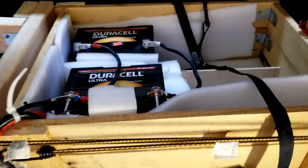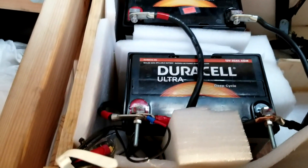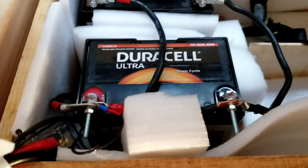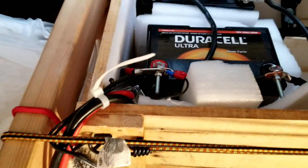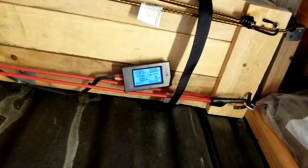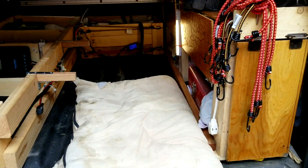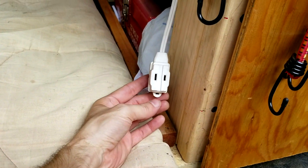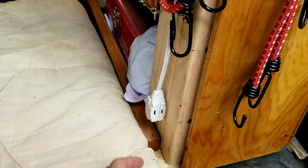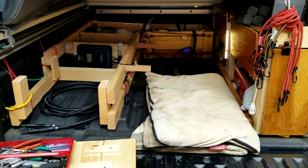There's the switch for the charge controller to turn it on and off. The batteries are back here in the battery box — I have room for four, and when I go out longer I take my four big ones. I've put insulation and cushioning in there to keep the shunt resistor away from the positive line so it can't short out. The install is alive — it's showing 12.89 volts. I have 12 volts DC available here, and just across the way I have 110/120 AC from an extension cord that wraps around to the inverter. It took me an hour to put in.